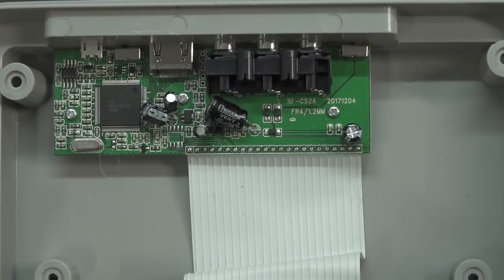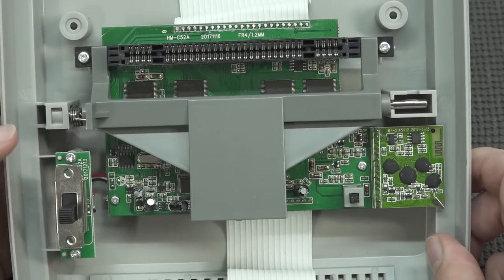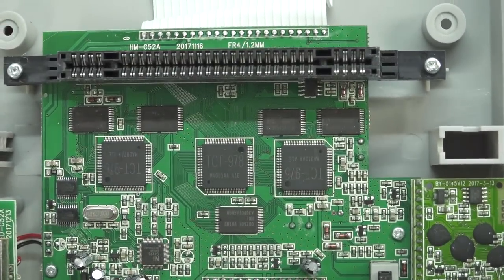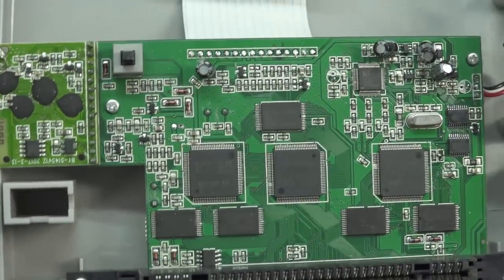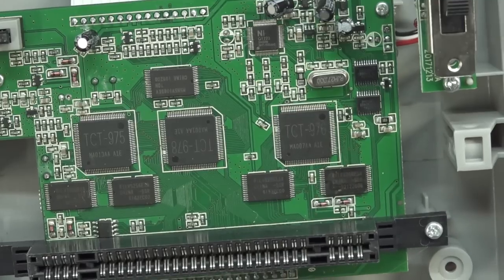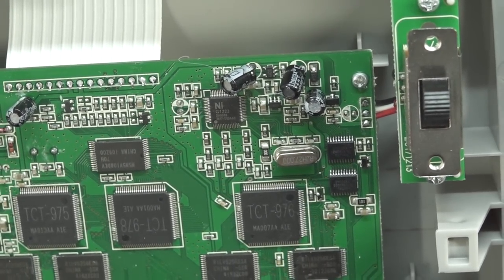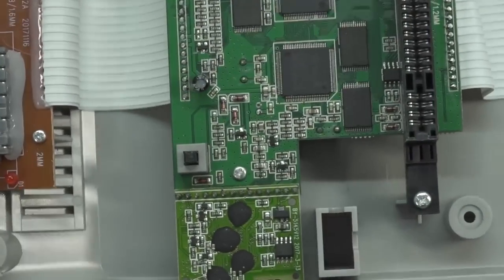The PCB was made in 2017, so this thing is already a couple of years old. Here we get the chip needed for upscaling to HDMI signal, the AV out option, the region switch, and the micro USB 5V input. On the main board there's a lot happening. We have three different processing chips: the TCT 978, the TCT 975, and the TCT 976. It's quite interesting — I've never seen this before. Maybe it's related to the NES part and the Super NES part, though I honestly don't know if it's emulation-related or how they're mimicking this.